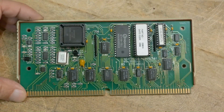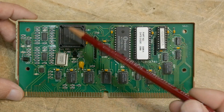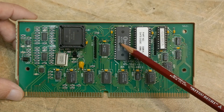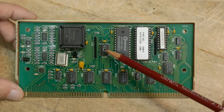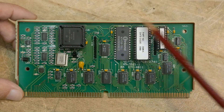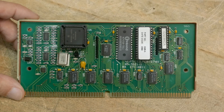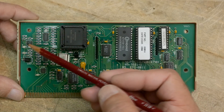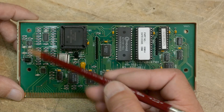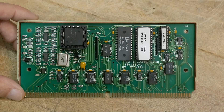Let's take a look at the board. This is the board we're going to be playing with. It has the processor here with a lot of pins — it's in a surface-mount package but on a socket. This is our RAM, this is our ROM, and this is the GAL that does the address decoding. Here's the address latch — so basically this is the whole computer right here. The rest of it is just buffers for the other part of this product. Over here is a precision voltage reference to be used with the ADC to give you better values.